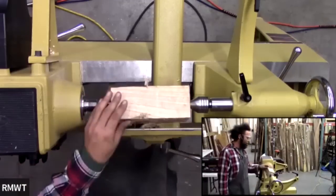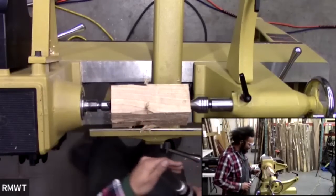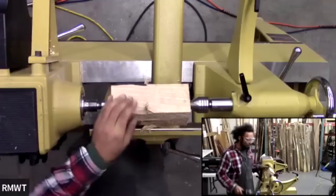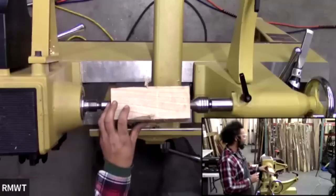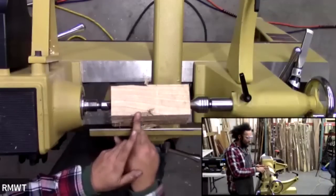That's terrible, actually. What I have right here is the introduction to a nice shear cut coming this way to, in this case, the right. In this case, I was leading with the shorter point of the skew, the radius or the heel. And the only reason it's good to do this first is to take a good look at grain orientation. If you see that I'm making my first cut is shear sliced into the fibers this way, that's actually quite clean. Not so much over here.